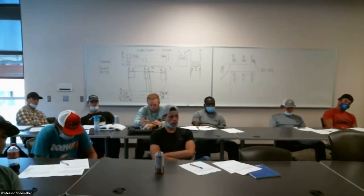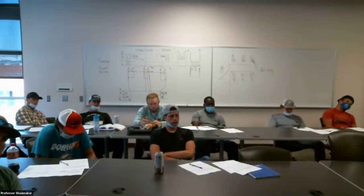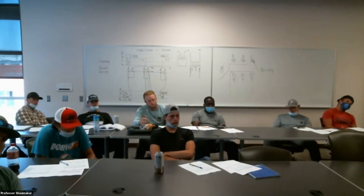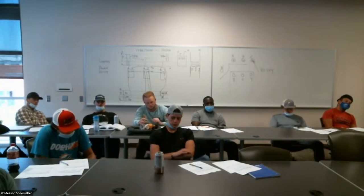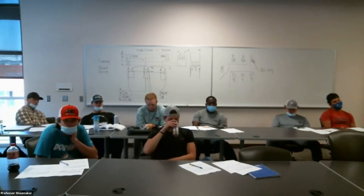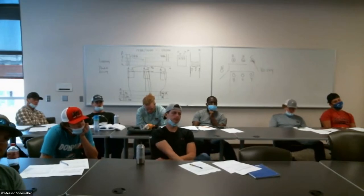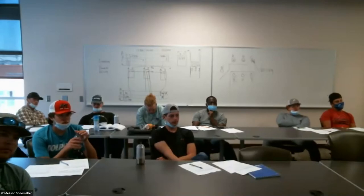There are time of day demand type meters that you're going to see out there. But that right there is a blessing if you've got a business. I mean, think of it. They're at the Myrtle Beach Convention Center, and I'm going to take the whole convention center out. Pull the meter out. Another nice factor of this too is how much load is that business carrying? A lot. 200, 300 amps, right? What's going to happen if you just pull the meter out? It's going to draw an arc on it. Throw the handle up. No loss of connection.